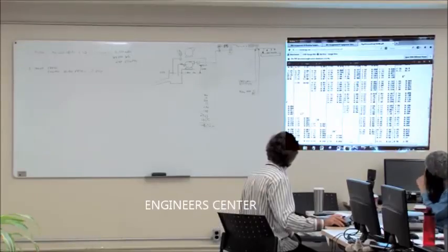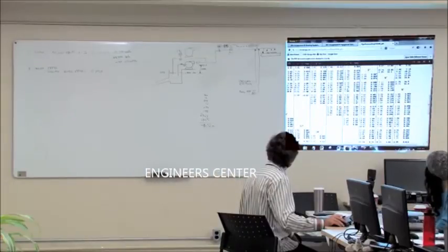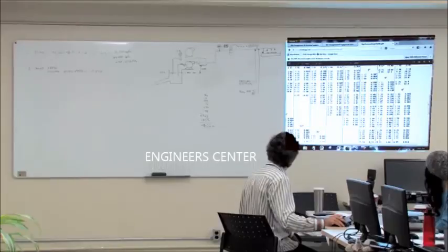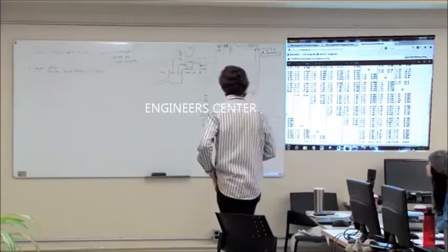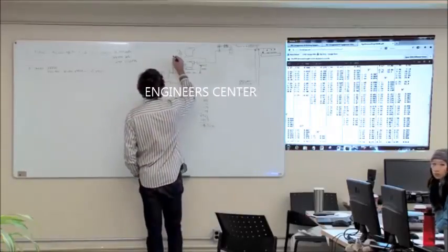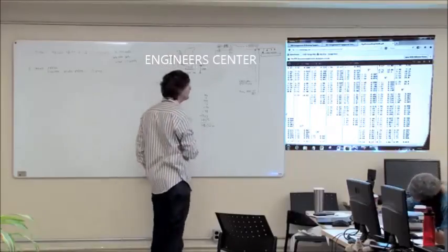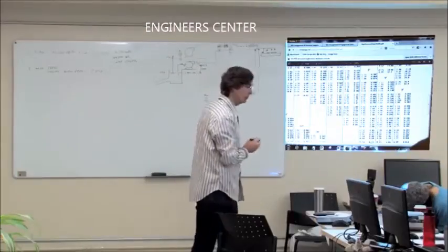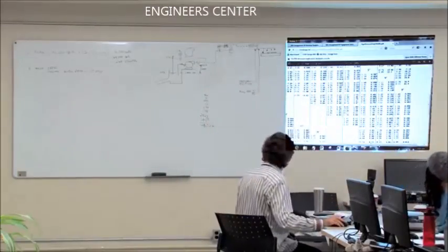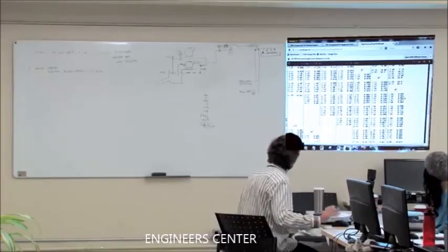There's 3 feet per second, 0.195 psi per 100 feet. What size line is that? 6-inch line. All this stuff isn't that big at all. I think I'm going to go really conservative because it's a short line, and I'm going to go right to an 8-inch line. Could do 6-inch, but I'm going to do an 8-inch. And so my pressure drop is... I lost my line there. Third one down, was it? Second one down. 0.051 psi per 100 feet.